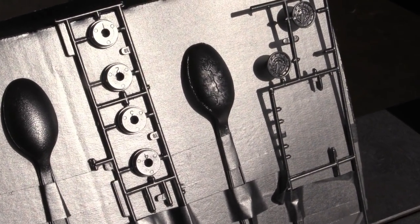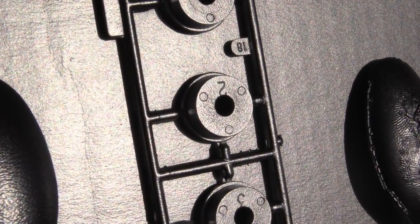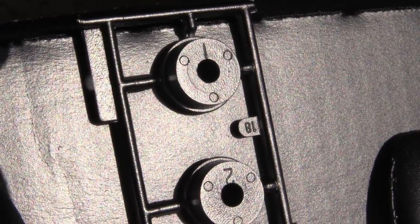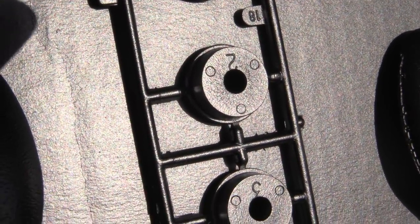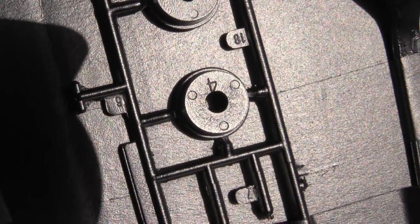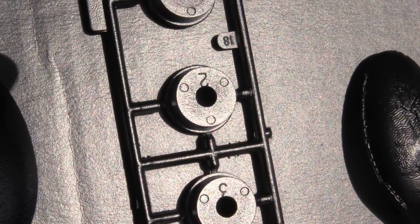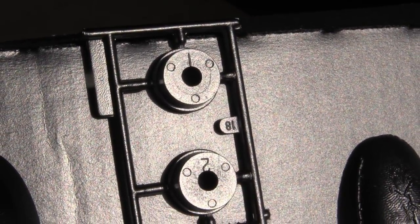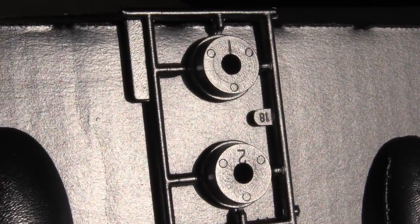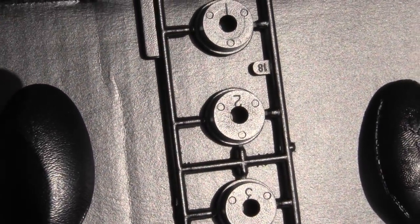Okay, so this is what we have now. Just finished the 10th coat on these parts here. And as you can see, since it had no primer coat or no base coat whatsoever, we did have a little crazing on the plastic. And so that is verified. This paint absolutely has to have a base coat of some kind. Otherwise it's on plastic, otherwise it's going to do this. And so that just verified that.